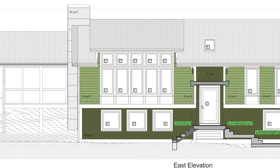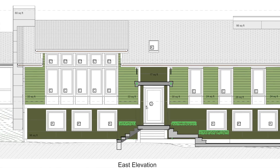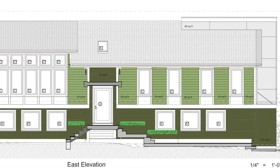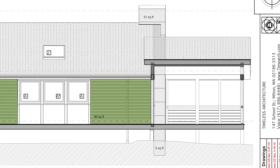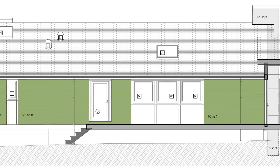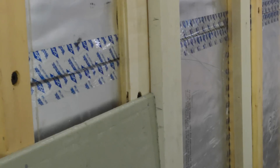On houses with lap siding, it makes sense to use a story pole to keep the courses consistent. The siding on this house is broken up by windows and doors, whose trim extends the full height of the wall. So the layout's very simple — small sections of siding fill the spaces between. That means there's only one reveal pattern, so only one story stick.